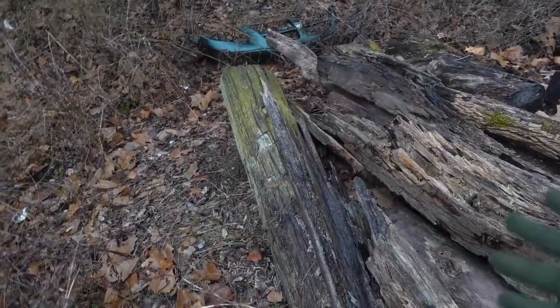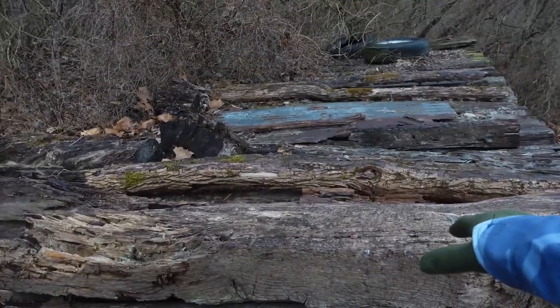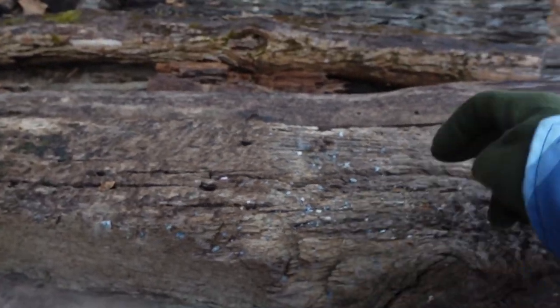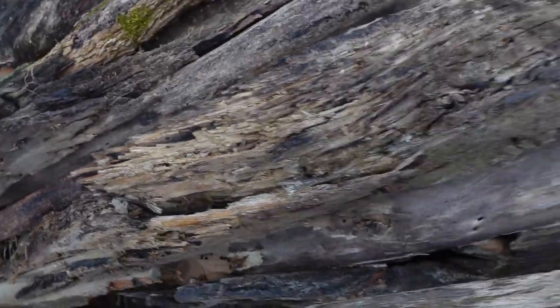We haven't had to do any repairs to the dirt for a long time, and this is probably now the world's heaviest dirt by volume because it's probably about 50% lead at this point. The cool thing about that is the bullets that land in the dirt end up acting as a bullet shield themselves — it's sort of self-healing in that regard. Once we had the dirt mound built up to about this high, we were going for a 30-degree angle. You can see it has sunk some as the beams have settled. We put this roof on here to prevent frag from going everywhere, and you can see this tie has been flipped over because it started rotting.